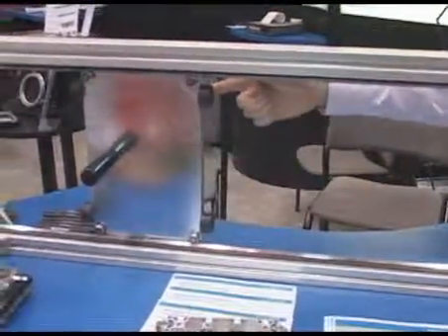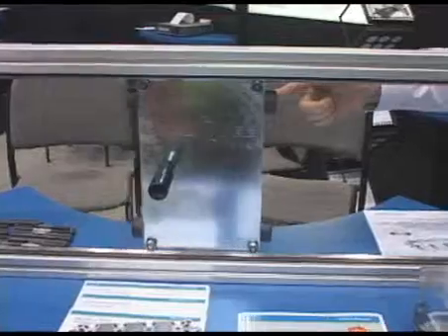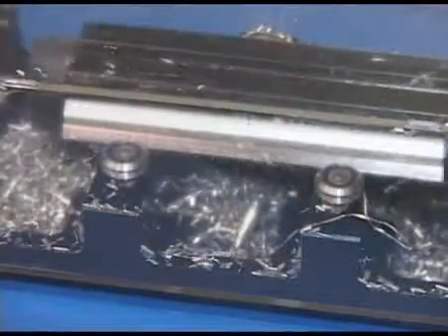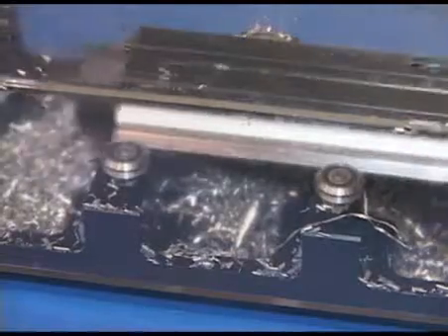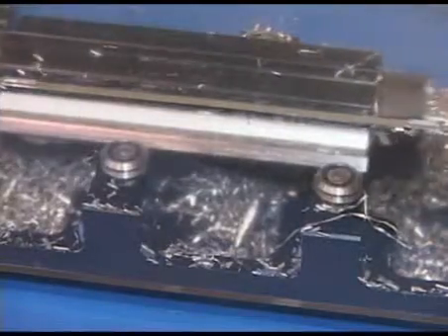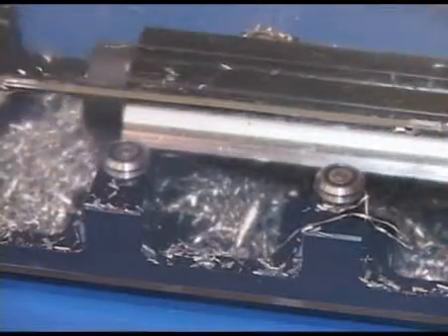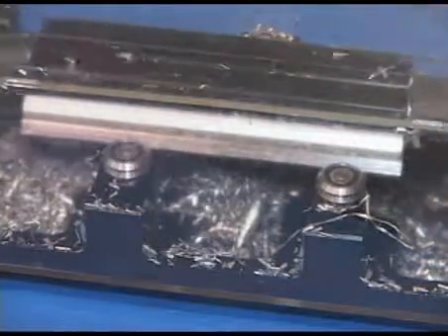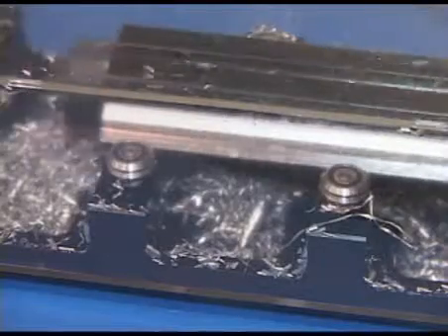The wheel technology is excellent in dirty environments, so it will sweep contaminants away as it's operating. This demonstrates our ability to go through contaminants. As you can see, the steel debris rolls on the track and as the wheel moves, the inner V moves at a faster velocity than the outer V, thus sweeping away debris.